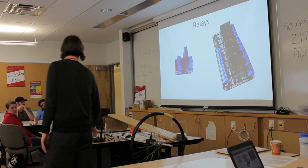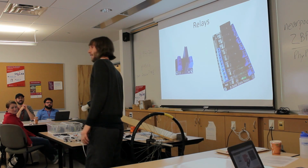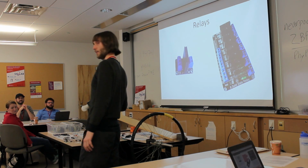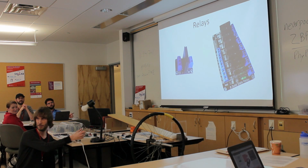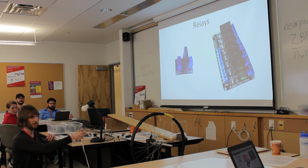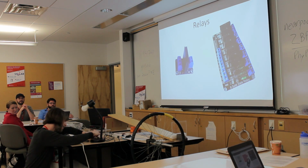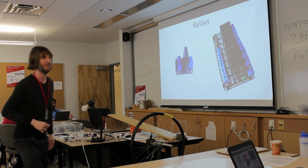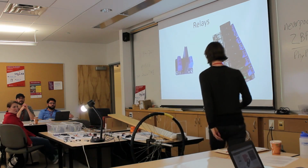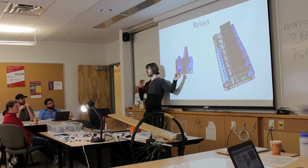So what I've done is just an Arduino Nano here, and I have a relay. The microcontroller is actually going to control this lamp right here. I'm going to power that Arduino Nano just with a 9-volt battery. So this isn't connected to a computer. I've already uploaded the code onto the Nano, and I'm just going to activate that code by giving it power here. Okay, there we go. So the lamp is controlled by a $5 microcontroller now, getting power out of the outlet, but using the relay as the switch.